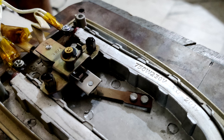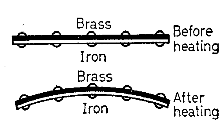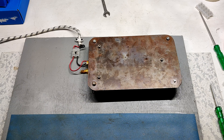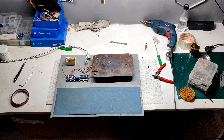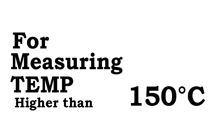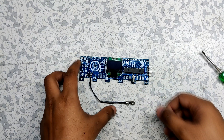The thermostat is an important component of an electric iron that regulates its temperature. When the iron reaches a certain temperature, the thermostat turns off the power. This mechanism consists of a bi-metallic strip made from brass and iron. When the temperature exceeds a certain limit, the strip bends toward the metal with a lower coefficient of expansion, breaking the circuit. So the iron already has a built-in power cutoff. We only need a temperature monitoring setup that displays the accurate temperature of the copper surface — for that I prepared an NTC-based ATmega328PU setup which displays the hot plate temperature on an SSD1306 OLED display.